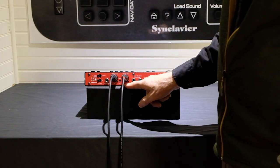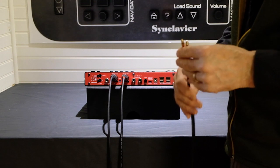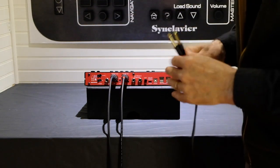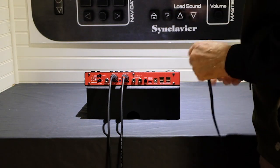The lift switches should remain grounded in virtually all cases. For simpler unbalanced audio systems, you can use two guitar cables or two quarter-inch TS cables from the unbalanced outlets.